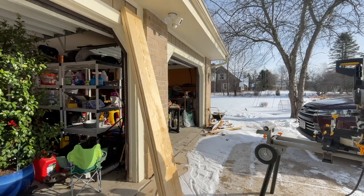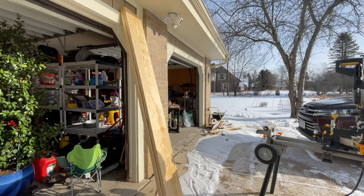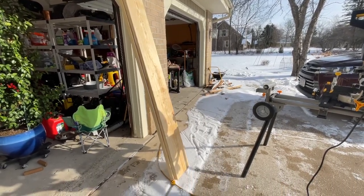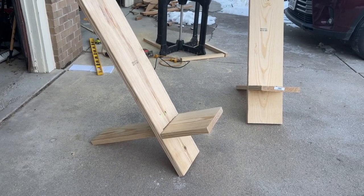I'm using a two by twelve. The actual two by twelve is eleven and a quarter inches by eight foot. I'm buying two of those to build two chairs. Each eight-foot board is going to create a single chair. It's not going to be put together with any nails or screws — it's basically creating a slot in one of the two by twelves, and then the other two by twelve is going to be cut to size so it slides into that slot.